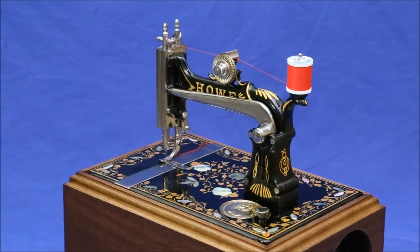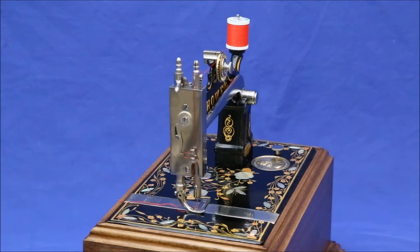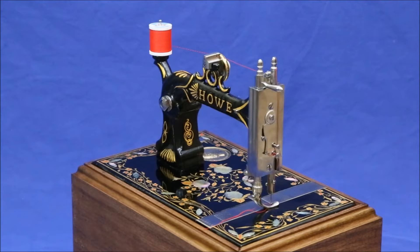And here's what she looks like after 130 hours of restoration. Broken and missing parts were repaired and replaced, the brass plates cleaned and replated, all metal work was polished to a mirror finish, moving parts were disassembled, and all sliding and rotating surfaces honed and reassembled.